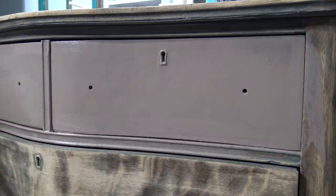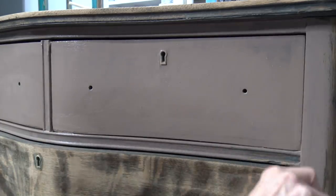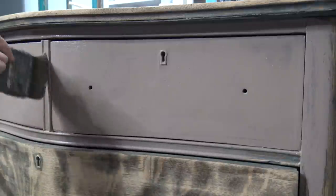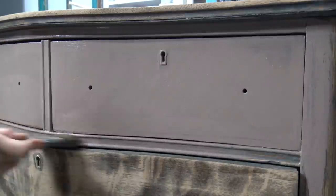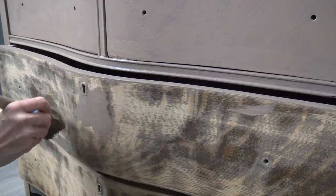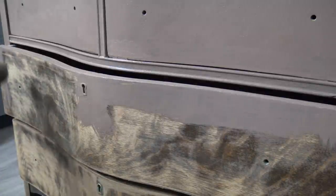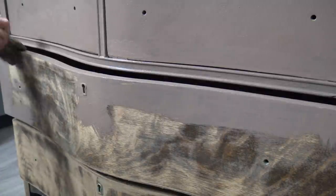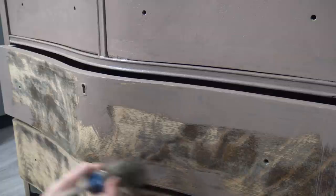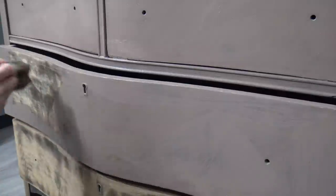Because I sell my furniture pieces, I like to take the drawers right out and paint the inside frames. Using these handheld flat chippy palm brushes is absolutely perfect — you can get a nice even touch along the frames, especially when they're thin, as well as around the frame of the drawers. There's no particular brush stroke needed, but I am doing random brush strokes because as I get into the second coat I want to create a little level of texture with the chalk paint.